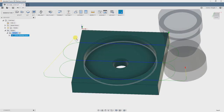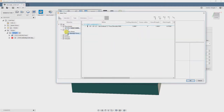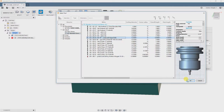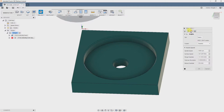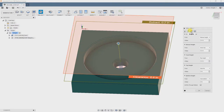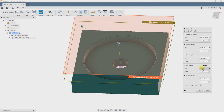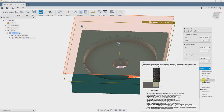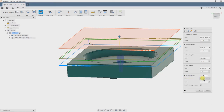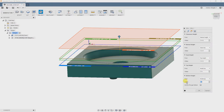This looks pretty good, so we're going to move on to our next operation, which is going to drill the hole in the center. Select Drill from the menu and the center drill from our library. Speeds and feeds are already predefined, so we're going to move on to the Geometry tab and choose the face where we want our hole to be. Once we've selected that, we move to the Heights tab. The surface of this hole doesn't match what we actually have left for our stock, so we're going to have to define those. First, we're going to define the hole top, choosing the top of the model. Remember that we've already taken material off the top of our original stock size and brought that face down to size. Since this is just a spot drill, we're going to go 35 thou deep, referencing from the same place we used for the top height, and set bottom height to negative 35 thousandths offset.